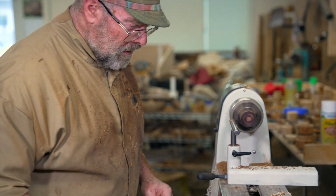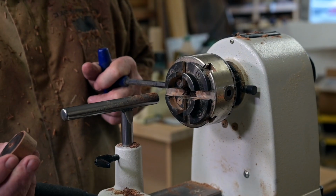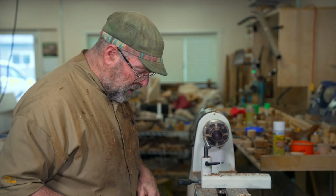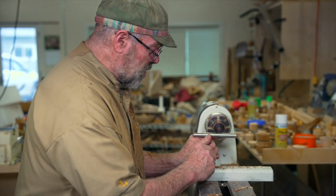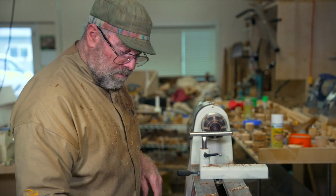Okay. Now I'll show you how to hollow out the lid first time, so I need to get this out of here. Okay, so the lid, I'm going to hollow this out first. And with these boxes too, I don't care how long your wood has been sitting in the shop, you need to rough turn them because wood always, and I mean always, adjusts to having bulk removed.